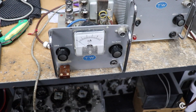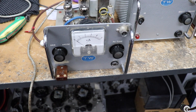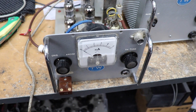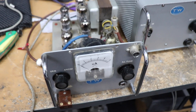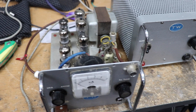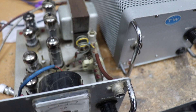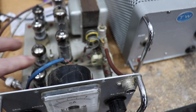Let's take a quick look. As you'll notice, there's a crystal in the front panel. The way this works: it's a crystal oscillator, and that crystal is based — on this one I think it's 6.9 megahertz — which is obviously a long way off from 144 megahertz. And then you've got a frequency multiplier.